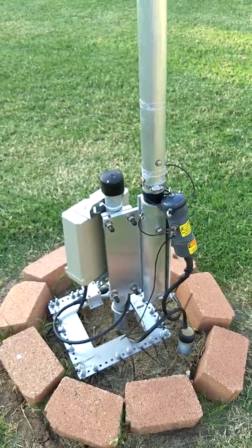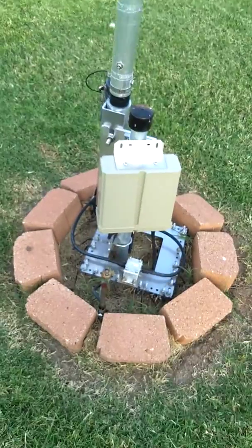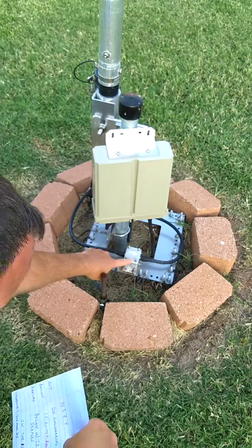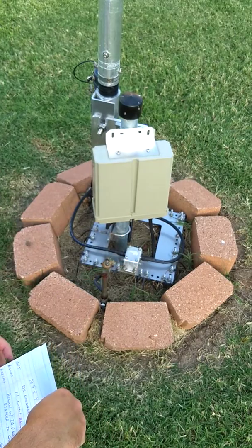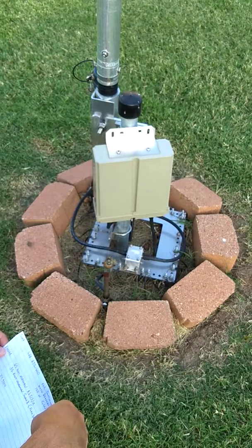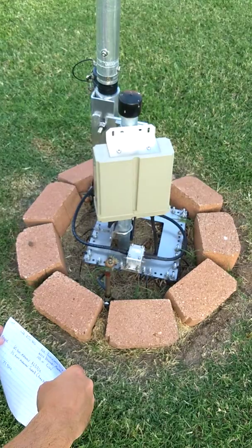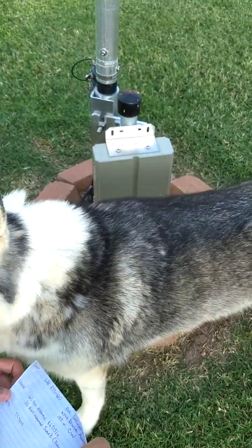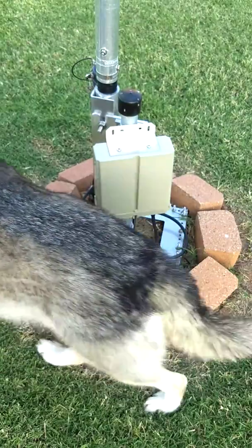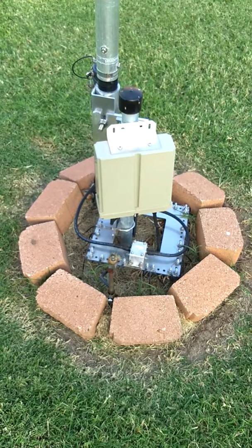The lightning arrester, which is over here on the other side, is the ICE model 303. And this tuner that you see here is the LDG-RTC600. Of course, I only have a 100-watt radio and no amplifier, but for continuous duty with digital modes or 100-watt CW, I thought the 600-watt model would survive a lot better than the 200-watt model would.